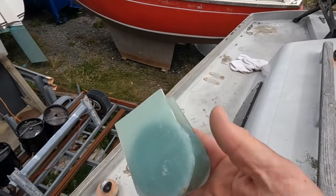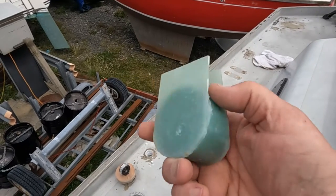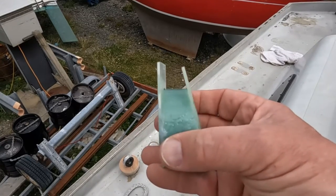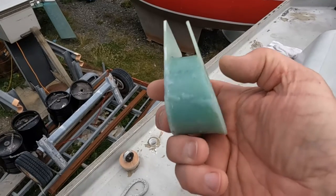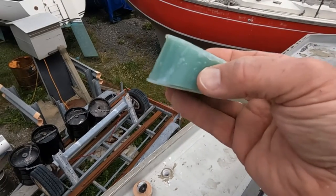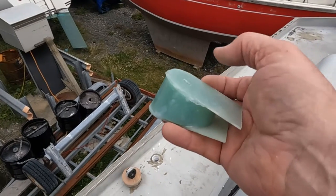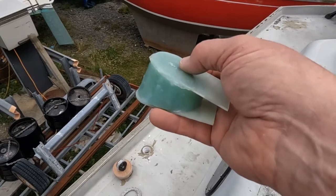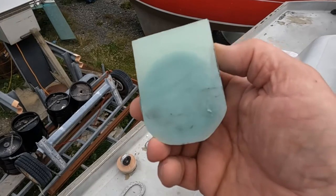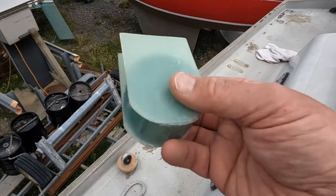I've also got my tangs cut to the right size of the rod and I've fitted the two end plates — they're not shaped yet properly. I'm waiting on the 12.7 millimetre drill to arrive, and then I'll put the Forstner bit to create the counter-bore and then the 12.7 millimetre bit to create the hole for the bolt. They're going to need some trim and a bit of sanding and will hopefully be ready to use.